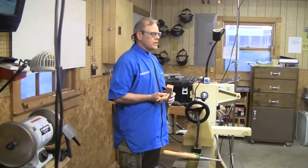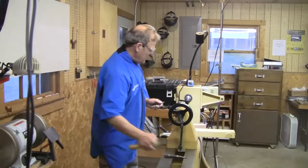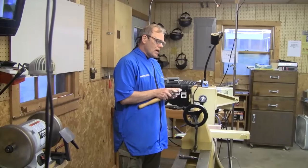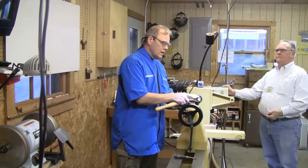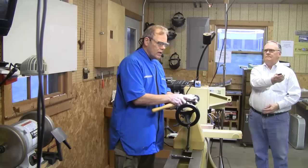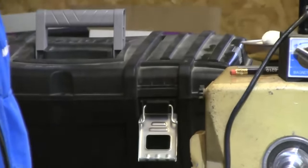I'm going to start off with a basic cut and go from the very basic things. We're going to mark the center. First thing we do, we're going to use this pencil to sharpen. We're going to talk about cutting the bevel, riding the bevel — it's similar to the way you sharpen a knife. The blade of the tool — this is the bevel — and you're going to ride or float that bevel in order to cut the supporting fibers. Who would ever try to sharpen a pencil the wrong way and pluck up the fibers? Keep that in mind as we go through this.